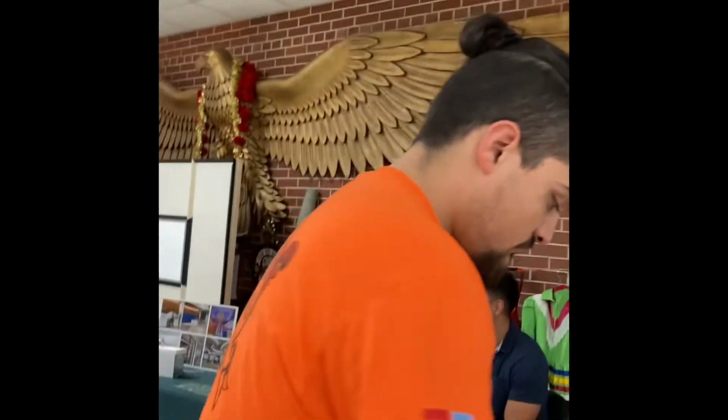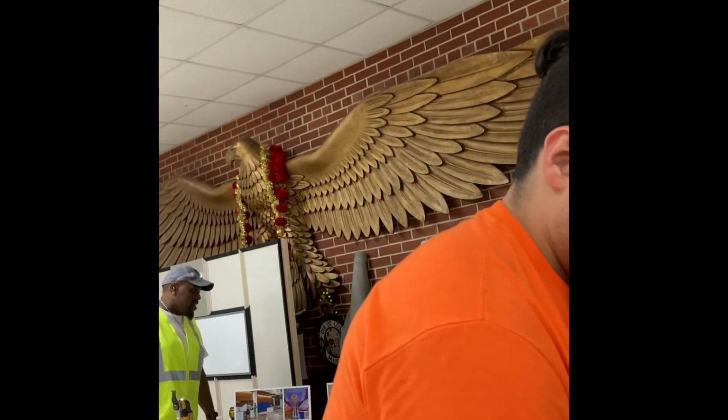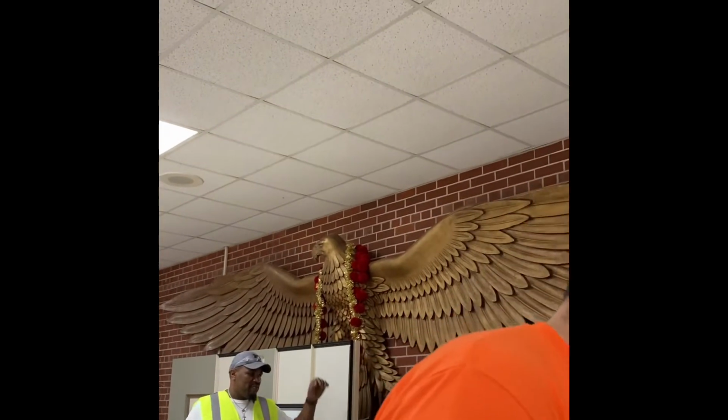See, this is just like a cap. So we got our flux. Put it on both sides of the pipe. You want to put it on what you're soldering and on this too. What that does, once that gets heated up, it will draw this to go inside that cap. And that cap only goes around the outside of that fitting. We want to fill that gap in between the pipe and the fitting to make sure it doesn't leak.